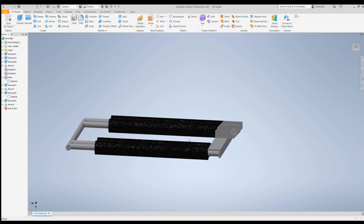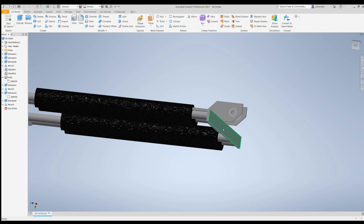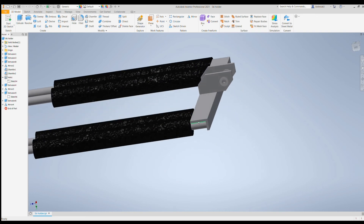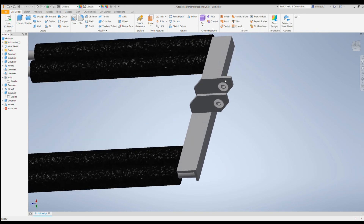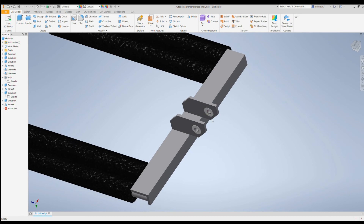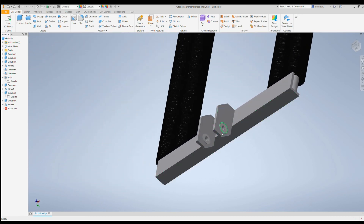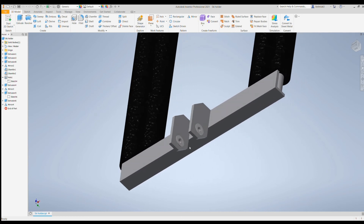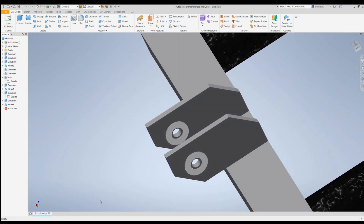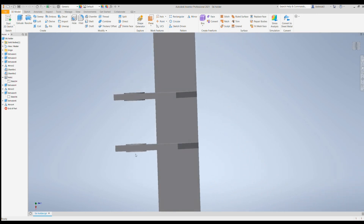I had them sitting around, so I decided to use them. These are quarter-inch aluminum plates that I'll weld together to create this L bracket, and these are also quarter-inch aluminum. Don't forget to put washers and accommodate for the space you need for them — that will prevent scratching of your bicycle rack.